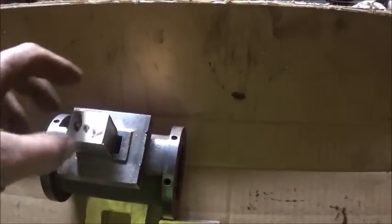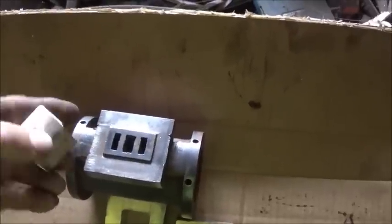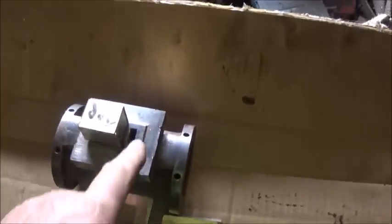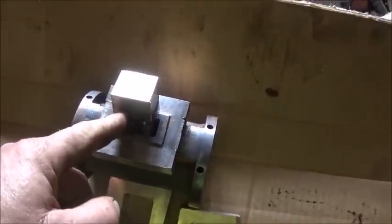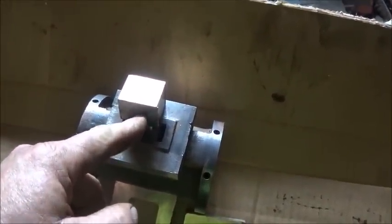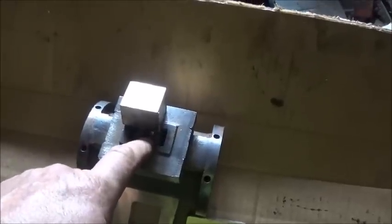So we've got to do some machining on the top of it. We've got to actually machine out a cup inside of it. So when it's covering, let's say, these two ports, it's leaving this one open for steam to come in, but it needs to leave it open for steam to come out this port, come up through the inside of this valve that we're making, or D-cup, and then come back down into the exhaust cylinder and our exhaust port, and then it exhausts out. Then it does the same thing when it moves.